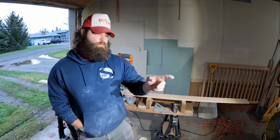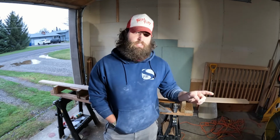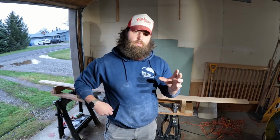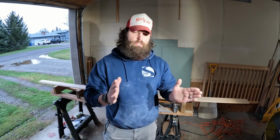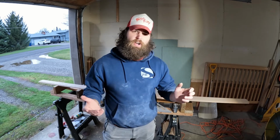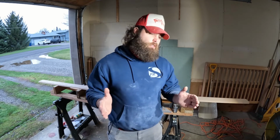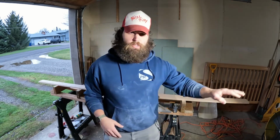But that's not what I wanted to mention. On those rails that I did, there's one thing I wish I would have done slightly different, if you decide to do something like this, or if you decide to buy these plans and build this yourself. The one thing I would have changed is that I would have cut both that 2x2 and that 2x6 about an inch to an inch and a half longer. And then I would have glued it and zipped it together, let it dry, and then chopped the ends down to length. Because what I ended up having to do was sand one side or the other pretty heavily to get those lined up. I did my best to get them lined up in the actual lay when I clamped them down and glued it and all that. But they still slightly moved, fraction of an inch, eighth of an inch, not a big deal to sand off. But had I just cut it a little bit longer and glued it, I could have chopped it down to length. Both of those pieces would have been perfect. So just something I learned in the process of doing that one.